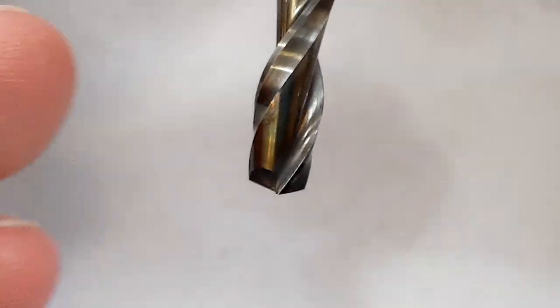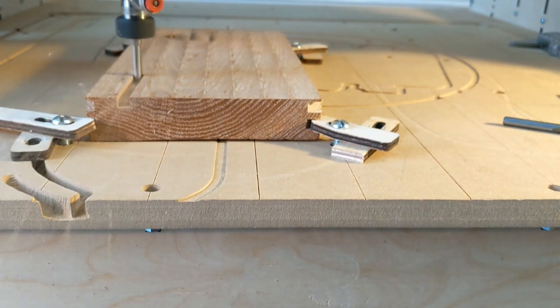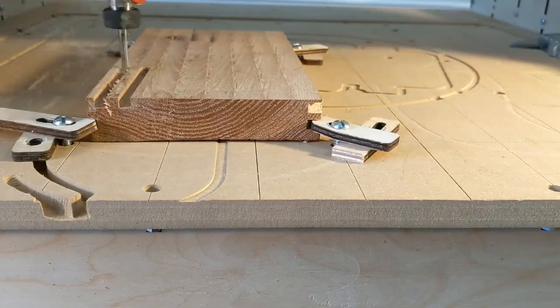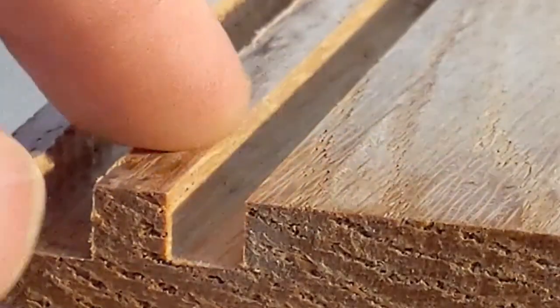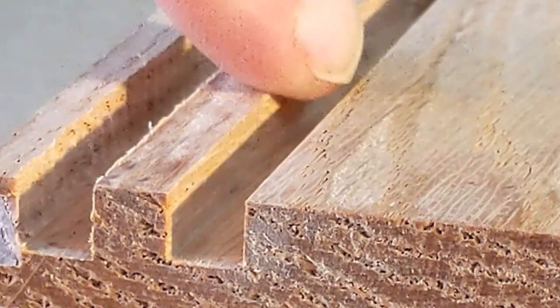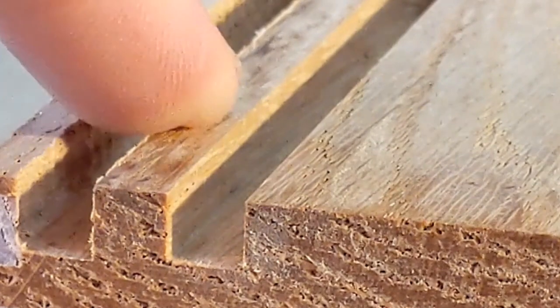It's got the bottom cut and therefore won't do that so much. Here's an example of the difference. This first cut is with a down bit, and the next one is with an up bit. If you look at the cuts up close, the one on the right is with the down bit. You can see that the corners are very clean and you don't have to sand them. Whereas with the up bit, the corners are rough and you're going to have to sand some wood away from that one.